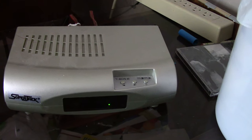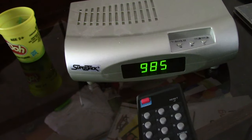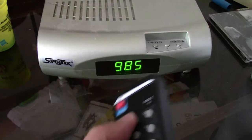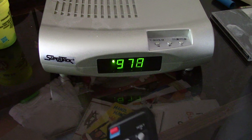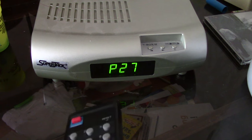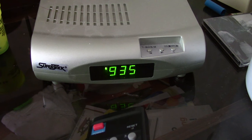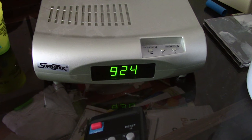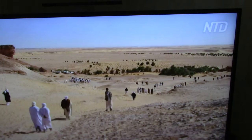One of the things you'll need to move a C-band satellite dish is a device like this. I use a Super Jack dish positioner. It comes with a remote and it moves your dish — you can have set positions. So for example, if I want to go to 127 West, I just enter that and it moves all the way to the 127 position approximately. There you go — I can see a picture on the TV screen. This satellite also has NASA and a few other digi-nets.